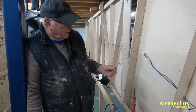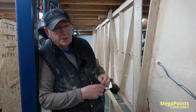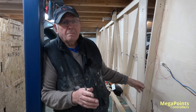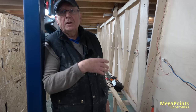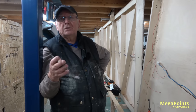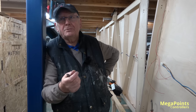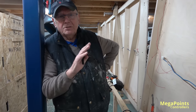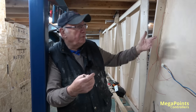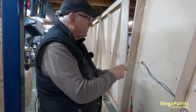You can't see 154 feet — you will not be able to see a train from one end to the other. Someone will have to walk or get somebody else to walk. We've discussed the simplest route for control: the signals will all work properly, but the controller will have to be supervised. There's no way we can put in the block detection we put in on Making Tracks Two — as much as it looked great, it was about as good as the chocolate banana for the kids. Nobody was looking at it. There will be track circuits on the front that we can see, but the back — forget it.